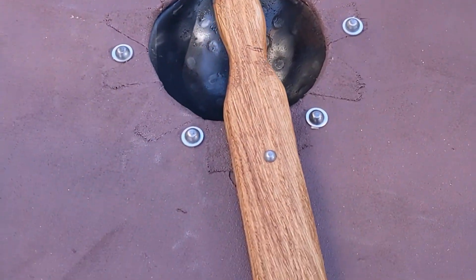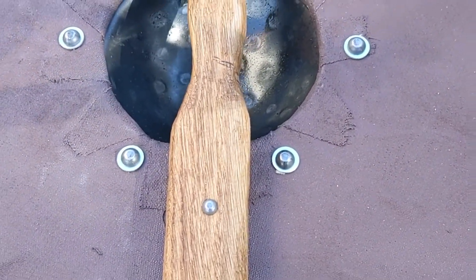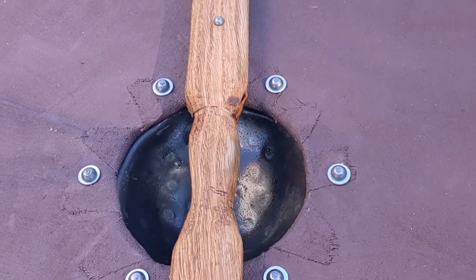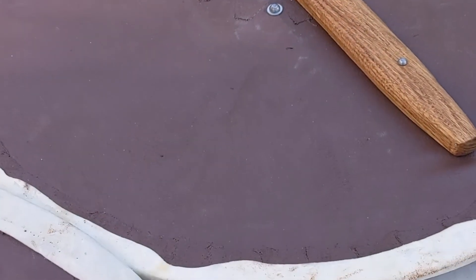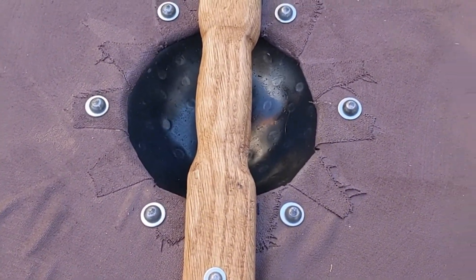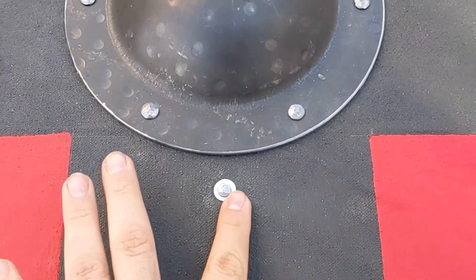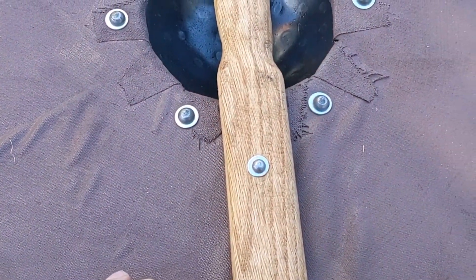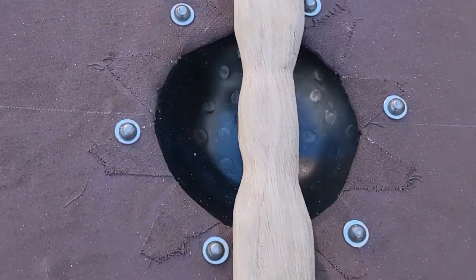As far as the rivets, this one we had some issues with not having rivets long enough, so we did not put washers on the back — kind of dangerous, but we'll see how it works. The wood itself is red oak so it'll be pretty strong. If not we can always fix it and put a new handle on. On this one we did put the rivets through washers first, so we got a washer on the back for added stability and a washer on the front. I usually do about three inches from the edge and then about four inches from that one — just space it out however you want. Follow me over this way and we have the handle ready to put on.